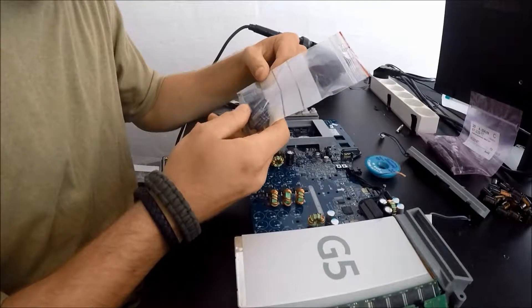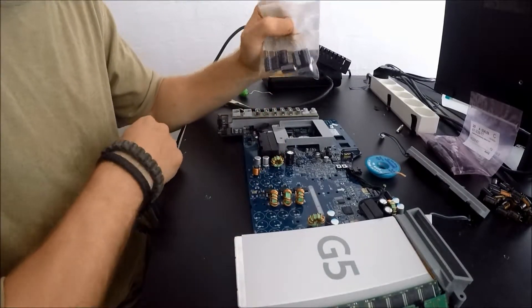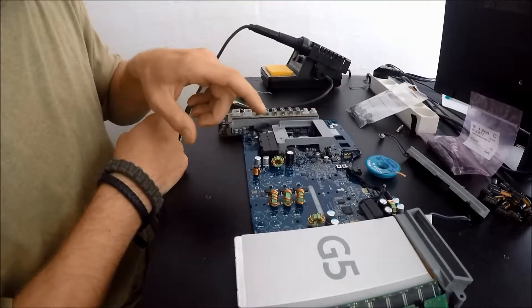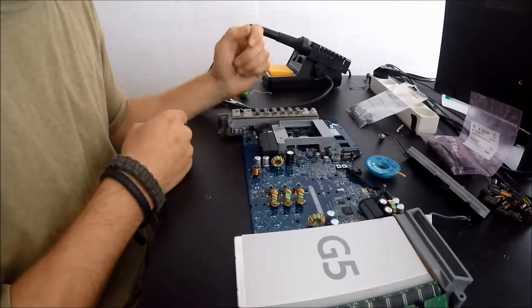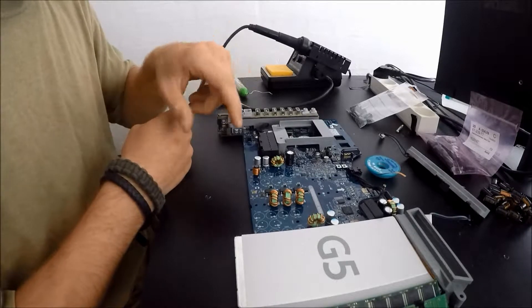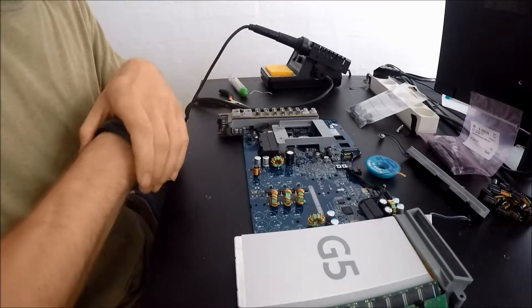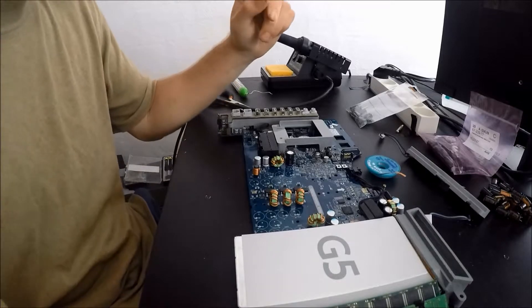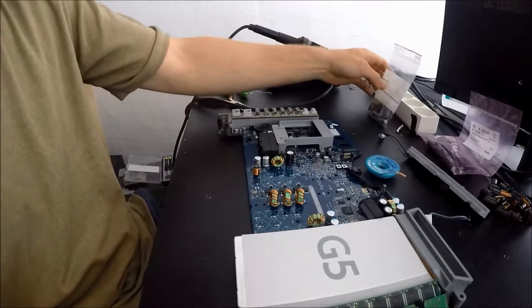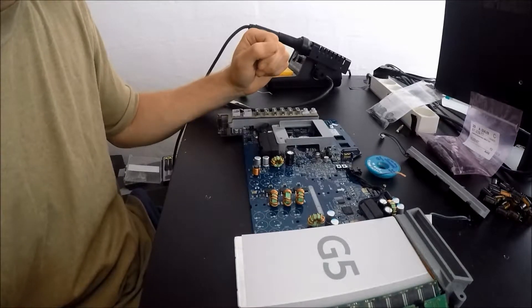I finally got the last components. I got seven 25V 1000µF capacitors - I believe I only need six, but I got seven just in case I screw something up and still have another chance. The original capacitors that were supposed to be in this area were 16V 1000µF, but the 25V ones were about half the price. From what I know, you can always go up in voltage as long as the microfarad rating is the same.